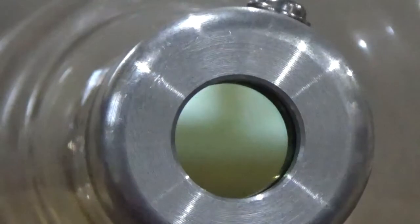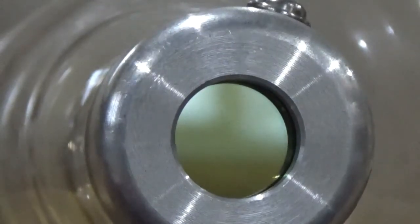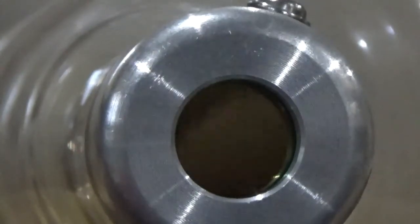Now, this tube has lost power. It's got a different problem. The helium inside of it is getting all burnt up, so it's just not as powerful as I'd like it. And that's really it. I've never been able to see a good photo of that — a good clean job of the fourth mirror in your laser, which a lot of people don't know exists. You can actually revamp and get more use out of your laser tube by cleaning that mirror off. But don't do it all the time because if you scratch it, it's not replaceable like all the other mirrors in the machine. But if you think your laser tube is done anyway, go ahead and clean it off. Take a look at it.